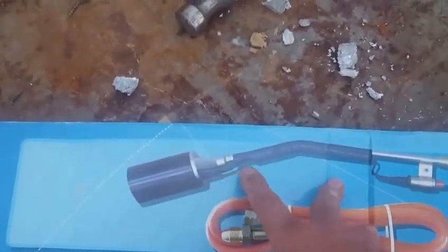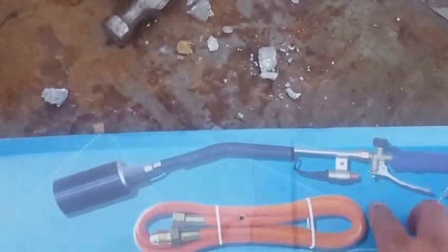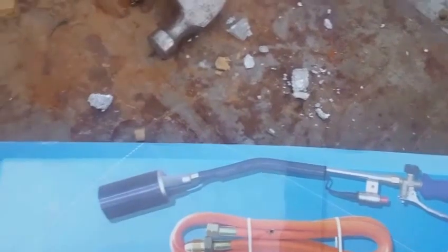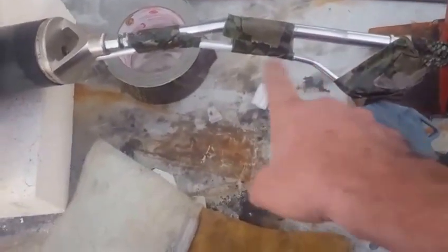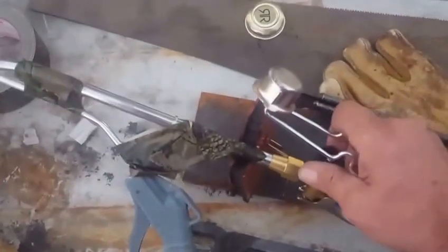Under this heat shrink is that aluminum tube, and you can see the wire for the piezoelectric. The first thing you'll notice is that it melts — it gets hot, melts, shorts out, and doesn't work anymore. So I'm probably going to reuse the clamp from the button as part of mounting. Over here there's a spike, and the aluminum tube, and a cheap Harbor Freight torch that fits kind of inside. I'm going to use pipe dope to seal that and then adhere it with JB Weld to make it permanent, then make clamps to hold it all together.